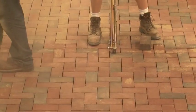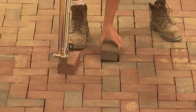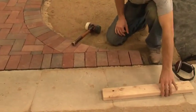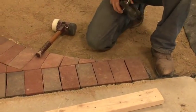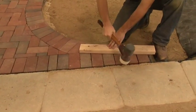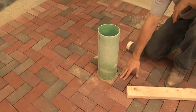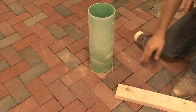During initial compaction, the person compacting should mark the broken pavers while another person follows replacing them. In hard to reach areas where your compactor may not be able to get to, one way of making sure those pavers are compacted is to use a 2x4 and a mallet. You can also use a 2x4 and mallet when compacting up against obstacles so you don't have to worry about your compactor accidentally hitting and damaging them.